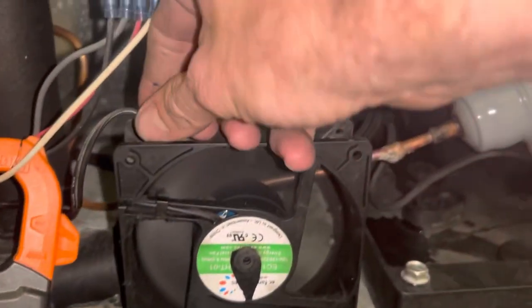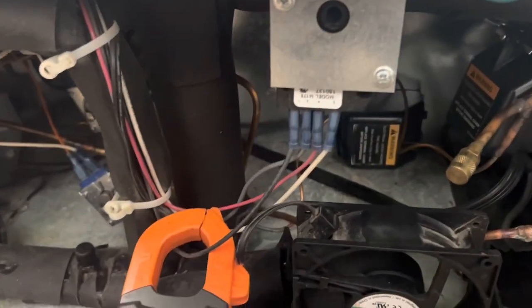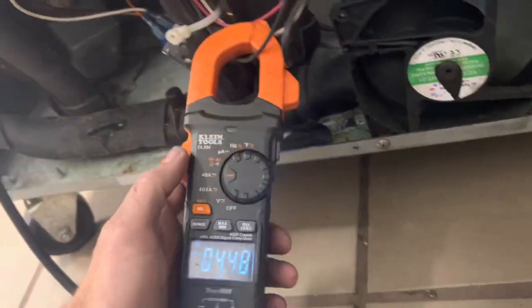All right, so that made a pretty immediate difference. The heat load back here — all right, I just dropped it into a defrost. I'm in a defrost now and my compressor hasn't dropped out. Let's see what's up with that. She finally dropped out — so that makes me happy. That means our low pressure control is good.